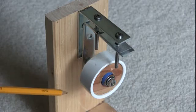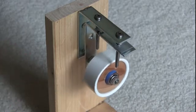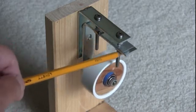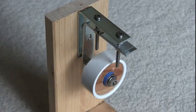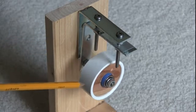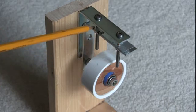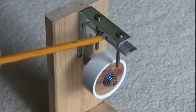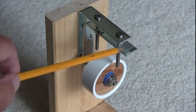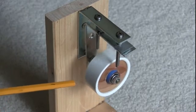It's also very important that this little adapter be allowed to swing and self-center. You see here it's also adjustable if need be. You can see there's a space between the two corner brackets — in order for it to swing free, you need to elongate these two holes with a quarter-inch drill. I've covered part of that elongated hole with a piece of tape to keep it centered where I want it.